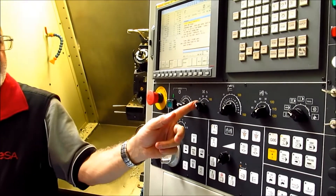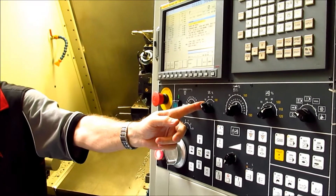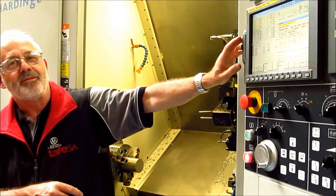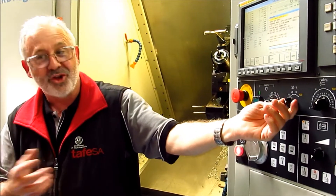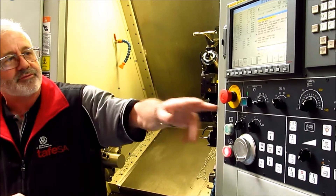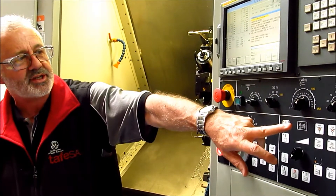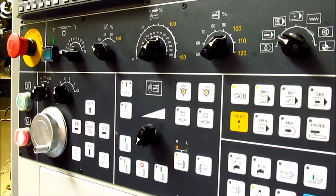It'll move, but unless it's programmed to ramp up it'll just go slowly. So the first person that crashed this was a colleague when we first looked at the machine — and I know this machine more than anyone else basically, because I teach it. I don't want my name engraved as the first person that crashed it, so I'll be pretty safe. You can override the spindle speed as well as the feed rate to get things dead right when you're close. There are a few different manual control modes, lots of controls on the buttons, and the default rapid is dead slow. There's lots of protective stuff — you have to turn things off to get it going straight out. It defaults to slow and single block mode, so it pauses line by line. It's pretty protective.